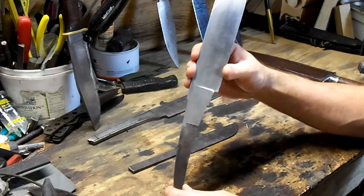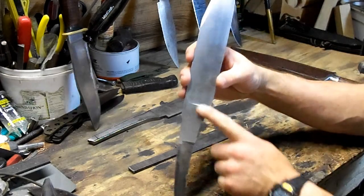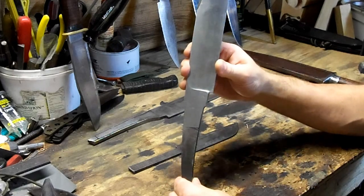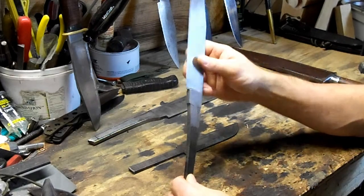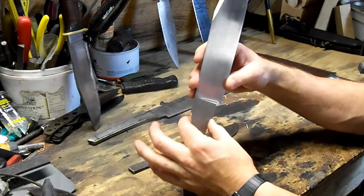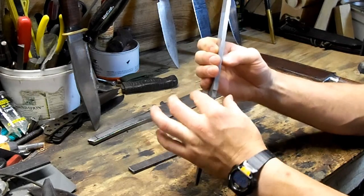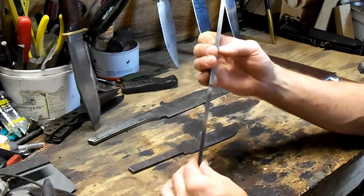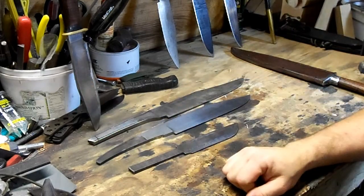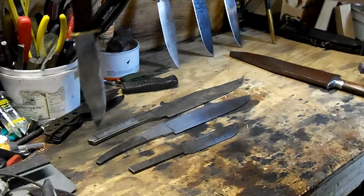Also, this knife is differentially heat treated. The edge is knife hard, there's a springy center section, and that springiness runs down into the tang area too. If you heat treat them correctly, a knife like this can last for generations. As long as you don't put any stress risers at the tang transition, heat treat the tang correctly, and don't drastically reduce the thickness, you're going to be okay. Narrow tangs are extremely rugged and they'll last a long time — they were used on swords for generations.